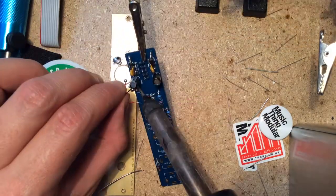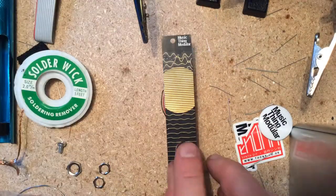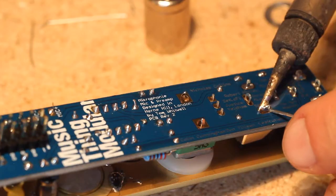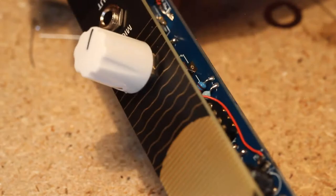When placing the panel components, accommodate them in the PCB, but don't solder them yet. First fit the jacks and pot through the panel holes, tighten the nuts, and then solder them onto the PCB. Put the knob on, the power cable, and you're done. Just check for shorts with your meter to make sure you won't see any magic smoke before you plug it in.